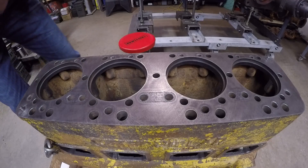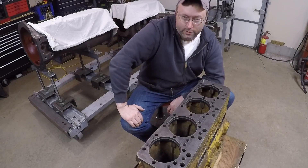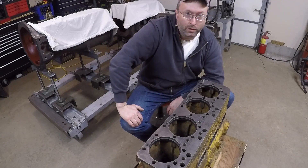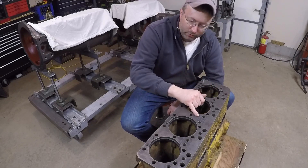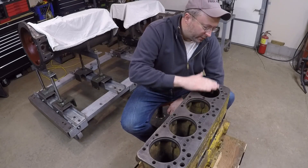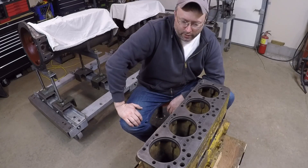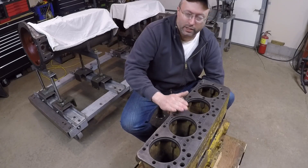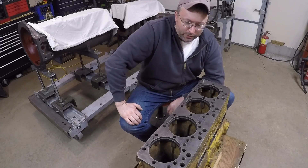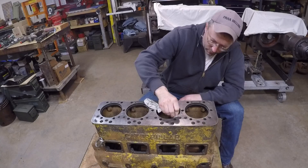We're good that way too. Honestly, it just doesn't need any more help. You can flame me if you want — I really don't care. I'm not taking this out to be decked, it just doesn't need it. I don't have excessive pitting around the coolant bores either. All the critical sealing areas are in good shape, no nicks or gouges. This thing is still within spec even for modern diesel engine standards, let alone 1939 tech. I know when these need help and I know when they don't.